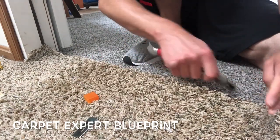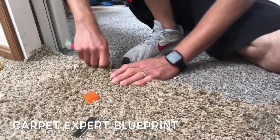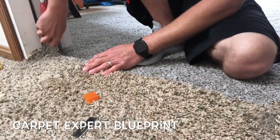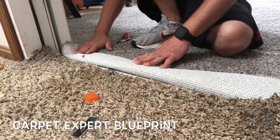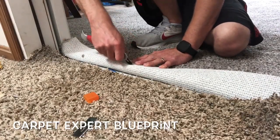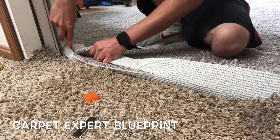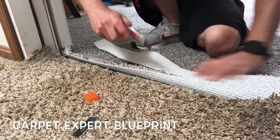A good, nice sharp blade will make a beautiful seam. Now I'm making little slits into the new carpet to line it up from where the seam line is going to be. I go all the way down, peel back the new carpet, and see all those little slits I put in it. I like to say we're playing connect the dots — just run your blade down and line one cut up to the next until you have a straight line all the way down, and then we are ready to burn the seam.